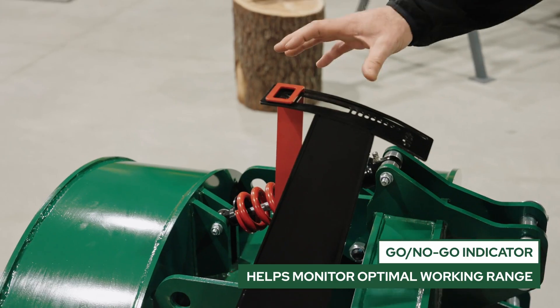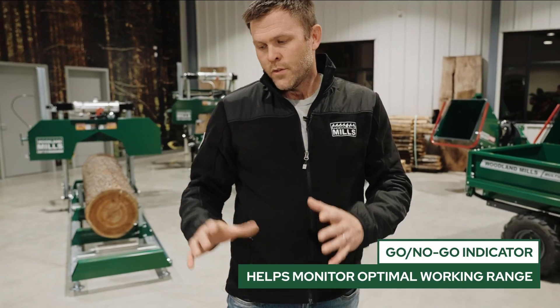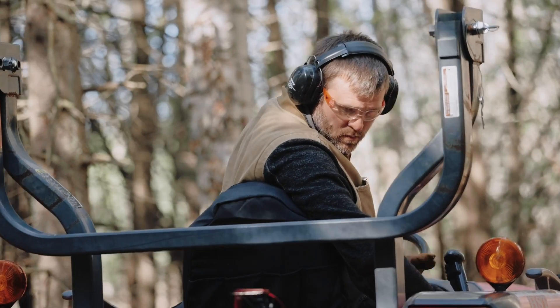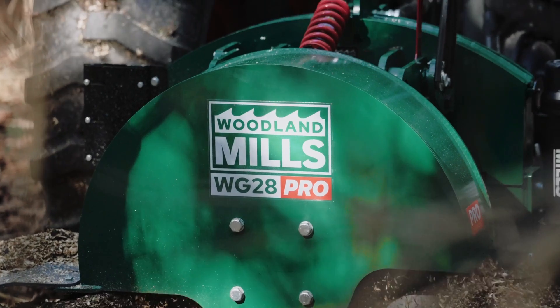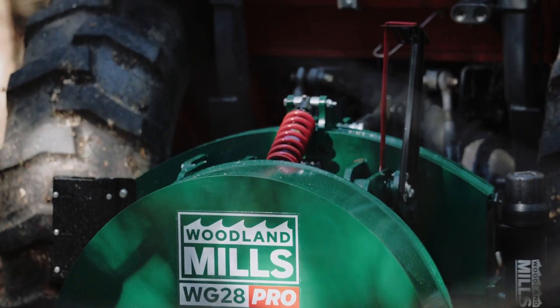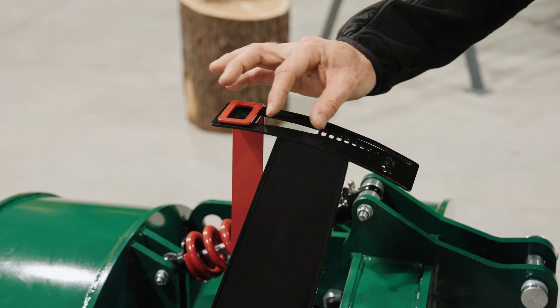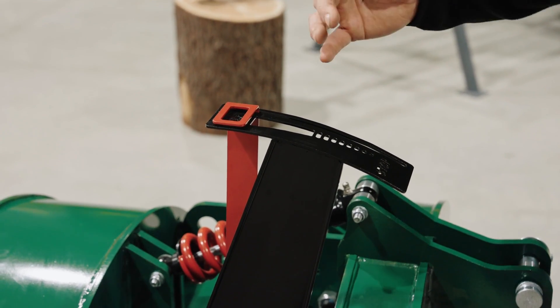To help us keep an eye on what's going on with the stump grinder, we've got a built-in indicator. This gives you a nice clear view from the tractor or the user position in your tractor seat as you look back into what angle the grinder is running at. We've incorporated a go and a stop position, as well as what we call an ideal location — the ideal pressure to be putting on the stump grinder to get the work done.